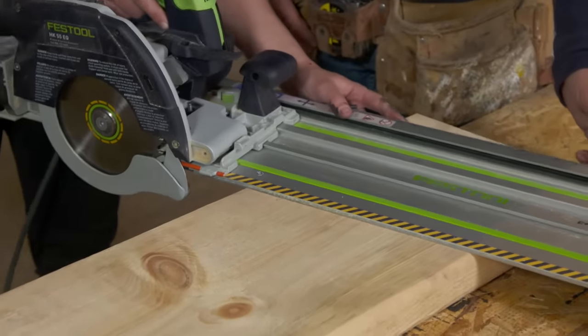To get to net zero, we need to put solar panels on this roof, and ideally those panels would face due south. But your roof line's not really cooperating here — we've got a north-south ridge which gives us slopes in the wrong direction. And even if it were in the right direction, I don't want to put solar on the street side. So the plan is to build a big barn in the back with a long south-facing roof — a roof big enough for the array we need. Very close to what we need. Well, you've got your tool belt — you're going to help us raise this barn? I'm ready to. Let's go.